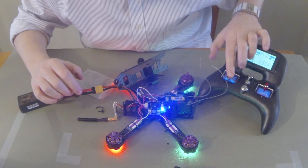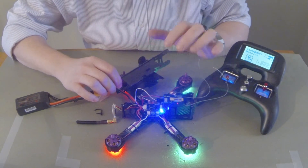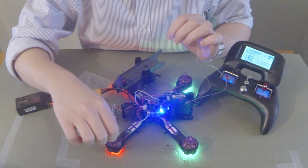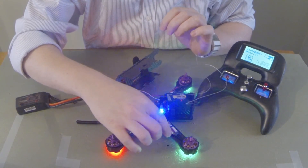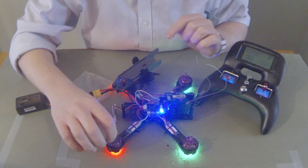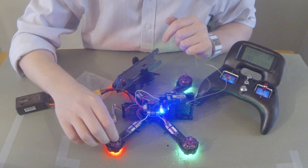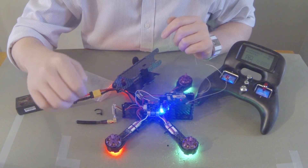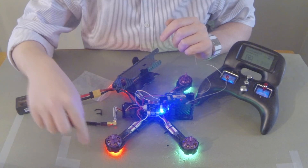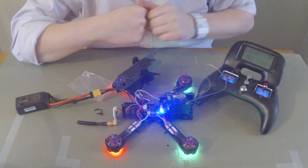Now if we go back and throttle up, nothing should happen — and the reason for that is the flight controller is still configured in PPM. So now we have to plug in and go into Betaflight. We could also upgrade the BLHeli-S software to get the latest firmware for the electronic speed controllers, and upgrade Betaflight as well — I believe it's running on 2.9 and there is currently 3.1 something. So I'll see you in the next video where we'll be configuring the Eachine Wizard in the BLHeli configurator and the Betaflight configurator. Thanks a lot guys, I hope you learned something — see you in the next one. Cheers, bye-bye.